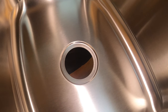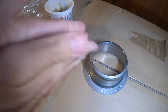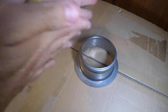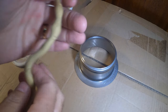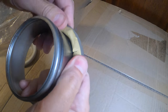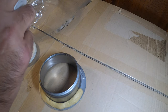The first thing you need to do is start out with some plumber's putty. What you want to do is take some plumber's putty, put it in your hand, get a nice ball, and just rub it together. You're trying to make a nice skinny little line of plumber's putty. Wrap it all around here — use the heat from your hands to make a long string, and just keep wrapping it around. Be generous and put it right around the ring, just like you see here. Don't be afraid to use as much as you need, because this is the most important part. This will seal the bottom of the sink so no water will get in, and that is super important.